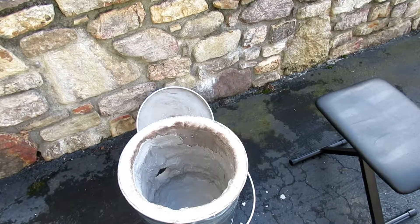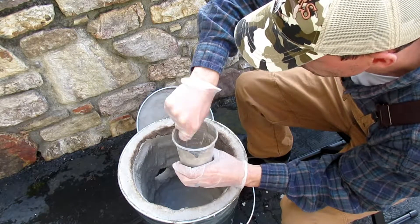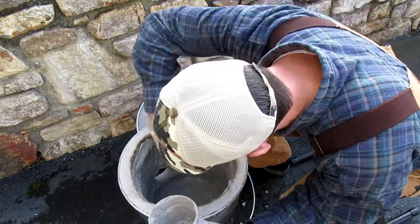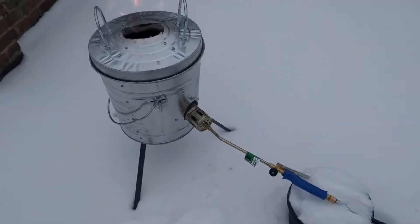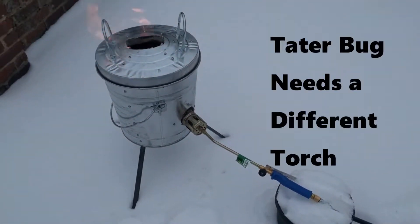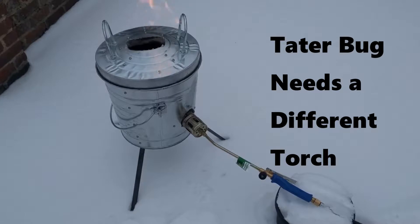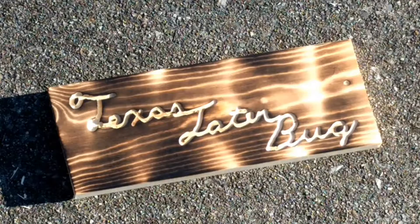Once the Satanite is complete, basically the furnace is complete. I'm so excited that I actually went out in the snow to fire it up with my torch and get everything up and running — but I realize this torch just isn't going to cut it. It's not pulling in enough oxygen, so all the flames are at the top because there's unburned propane coming all the way out of the opening of the furnace. I hope you enjoyed the build and we'll see you in the next video.